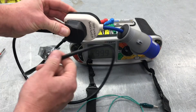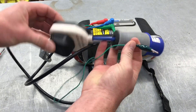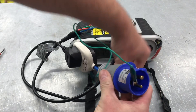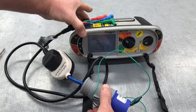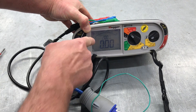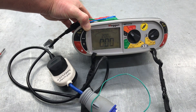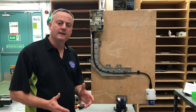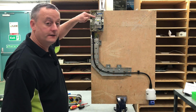I've got both the lead and the adapter. To have its resistance removed, I'm going to use a crocodile clip to link out my live conductors within my industrial plug. I've got a reading - I need to remove that resistance. I press the test button once; it isn't flashing so we are at zero at that stage. We're ready to carry out the first test which is part polarity, testing between line and neutral. My test instrument is all set up. I'm going to need to remove the line conductor from the top of the breaker.